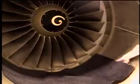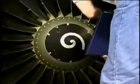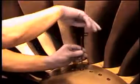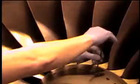If not already installed, place the protective flooring into the inlet. Locate the number one fan blade, which is immediately above the offset hole on the fan blade rear spinner. Use an approved marker to properly mark the number one fan blade. Note that fan blade and balance weight numbering is counterclockwise, forward-looking aft. At the first location where you need to install a balance screw, remove the existing balance screw. Lubricate the new balance screw with approved lubricant. Install the new balance screw and torque per the Boeing Maintenance Manual. Repeat the process to install the remaining balance screws.